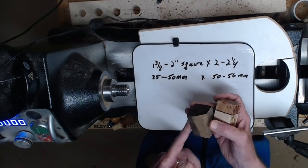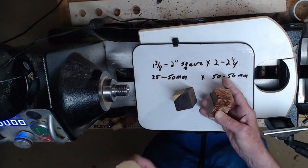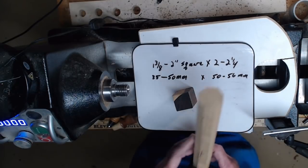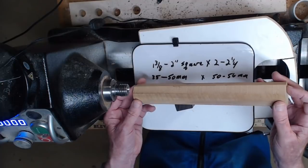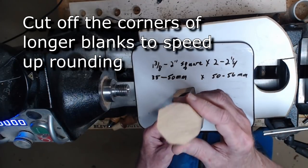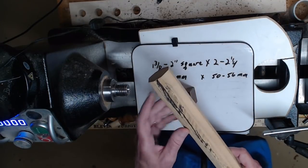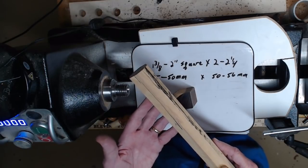You can turn these from acrylics, you can use exotic wood like this cocobolo, or even glued-up wood such as a piece of burl with a little piece of veneer and maple. Domestic woods are fine. If you're going to do a production run, take a longer blank and consider cutting it diagonally on your bandsaw or table saw — it'll make things run a lot smoother bringing it to round. You can use figured wood, spalted wood like this maple, burl, or just whatever scraps you have available.